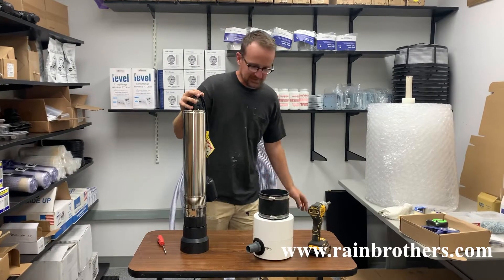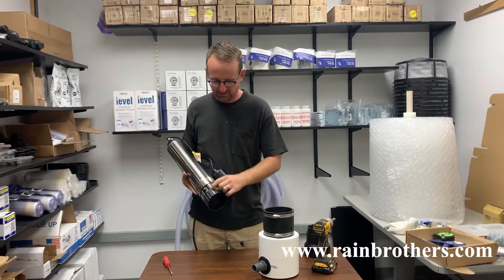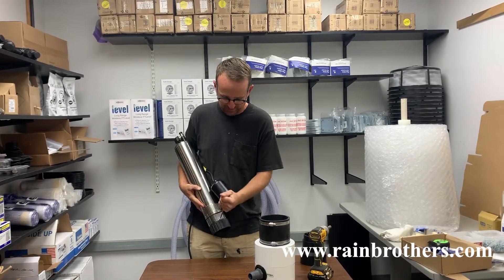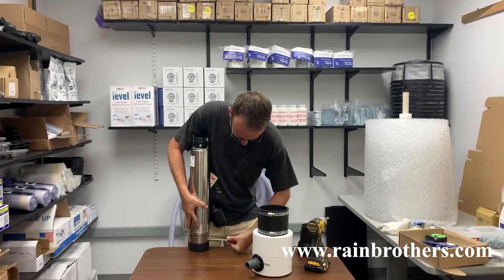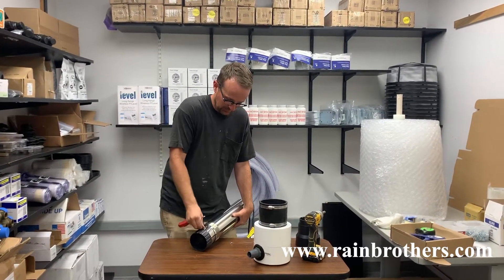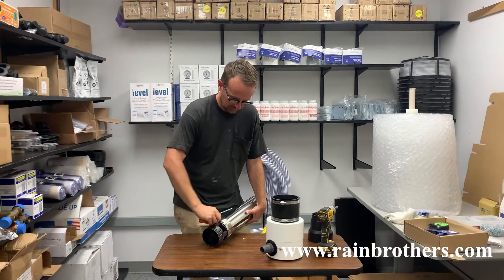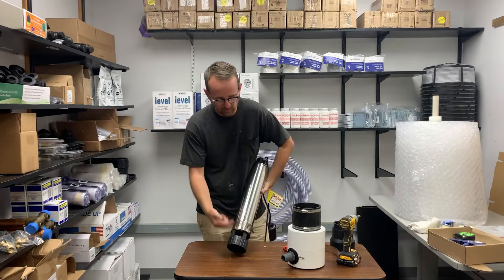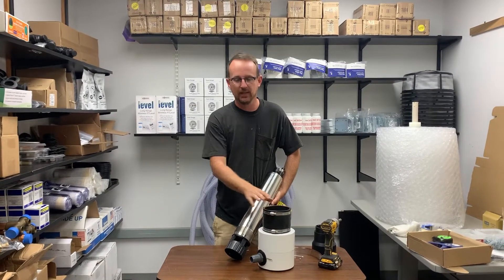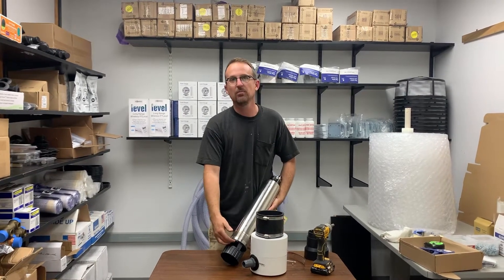If you're going to do the floating intake though, you're going to keep this stand off. You'll notice the stainless steel screen — there are two Phillips head screws holding it onto the pump. You're simply going to remove these two screws to take off this stainless steel assembly. This will expose the inside framework of the pump and allow for full flow into the base of the pump. If you don't use the floating intake, you will want to keep this screen on because it will keep large debris from getting sucked into the pump and causing damage.